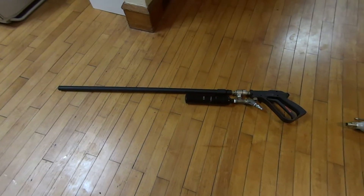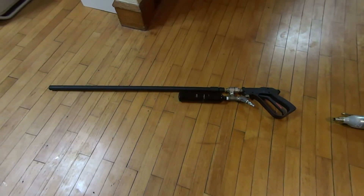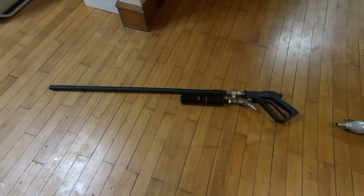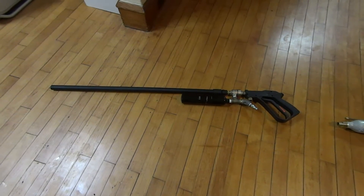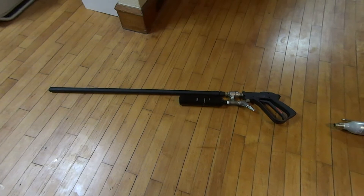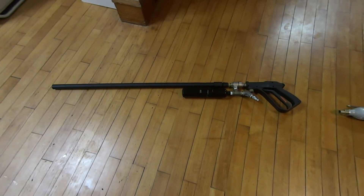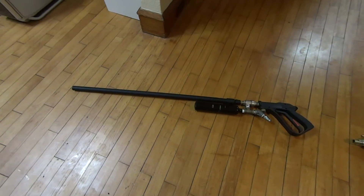I will go over the very specifics — exactly what I used to make this gun — and good luck finding some of the parts. I should say good luck finding the exact same parts, especially the handle — the pressure washer handle. Some of the parts you probably won't be able to find exact copies of, so the exact measurements and parts I used will be kind of irrelevant. Worth looking into your local hardware store and seeing what's around. Get a basic understanding of pipe threads and what fittings are available to you and what pressures they're rated at before you go messing around. Even at a low PSI of like 125 with a heavy metal projectile, this thing can be pretty dangerous. So that was my little disclaimer.